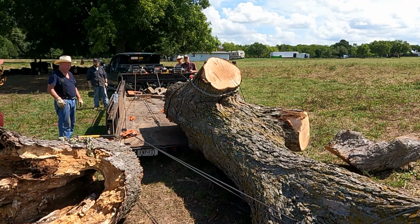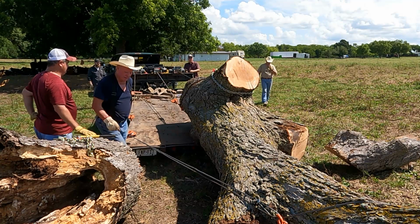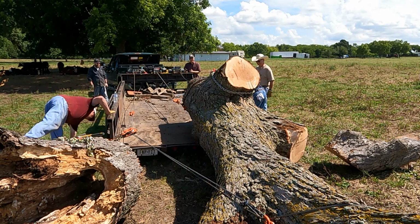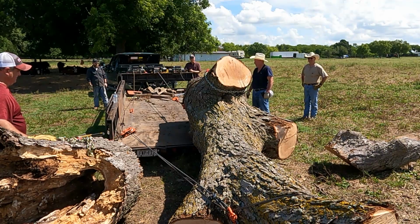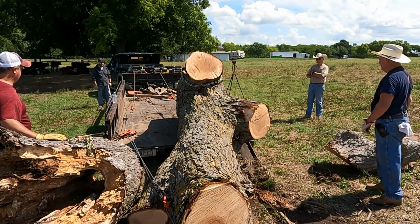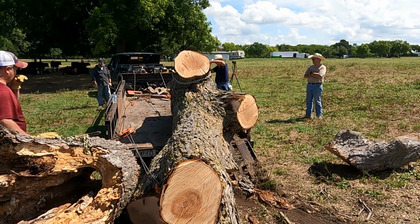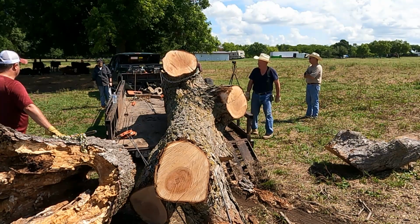You might ask the question of why I don't try to recharge the batteries out in the field by maybe hooking electric wires up from my truck battery and alternator back into the trailer. I've had several offers from friends that are mechanics to do that for me, and my big objection to it is if I get out somewhere and I run down the batteries on this trailer, I certainly don't want to start hooking my truck to it and run down the batteries on my truck, and then I'm out in the middle of some rural area in the middle of nowhere, and I can't crank my truck. I'd like to at least come home if the batteries go dead on my trailer. So I reserve my battery in my truck just for that. So I do not hook my truck up to these trailer batteries.